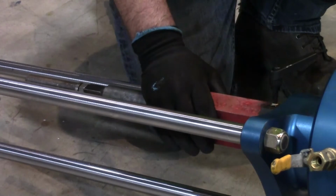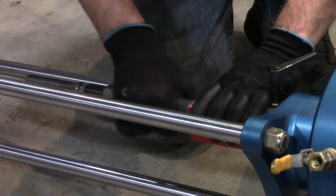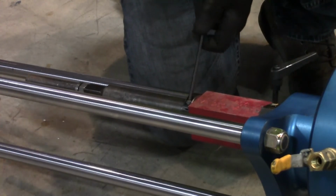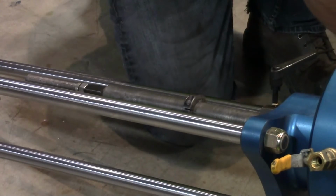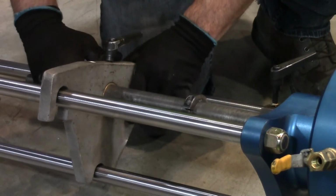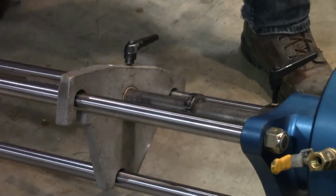Place the 4¼ inch Insta-Valve 250 insertion depth gauge on the insertion tool. Place one end of the insertion gauge against the packing nut assembly. Slide the stop collar towards the insertion gauge until the stop collar makes contact with the insertion gauge. Tighten the stop collar. Align the slots of the guide plate with the guide bars of the tapping machine and slide the guide plate over the insertion tool. When positioned, lock in place with the clamp lever.